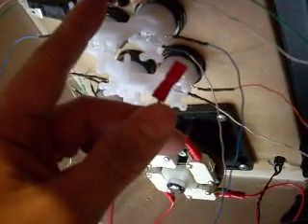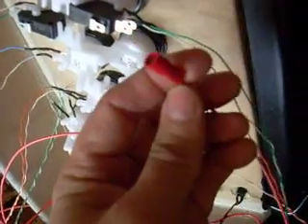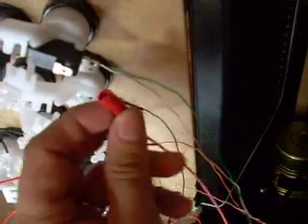Once you get the actual switch installed, then you run the cabling for it. There is a lead cable here that I indicate with red wiring. I bought this wiring at Radio Shack — I think it's 22 gauge — and I bought the clips from Groovy Game Gear. I recommend doing that because they're hard to find, especially in the right size for these micro switches. It's the .187 size female quick release clip. You can buy a bag of 50 of them for like $2, and I always keep plenty of them because I've taken on a real hobby of building these arcades and find some enjoyment in doing it.